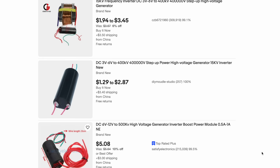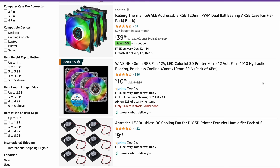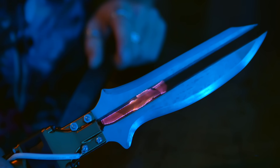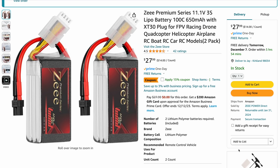In order for this to work, I was going to need the right high voltage power source. It needed to be small enough to fit into a handle and still leave room for a battery, produce AC, and provide enough current to fill the entire length of the blade with plasma. After extensive digging, I found a really compact high voltage board which produced over 10 kilovolts. I excitedly ordered a few of those, then started searching for a suitable PC fan and ordered a pair of 35mm fans. The last item needed was a small enough 3S lipo battery.